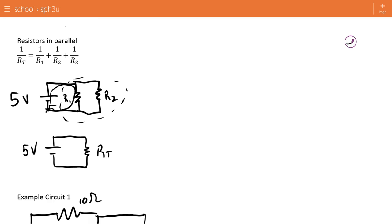We're not going to use Kirchhoff's Voltage Law for this one — we're actually going to use Kirchhoff's Current Law. Kirchhoff's Current Law focuses on the relationship between what I'll call IB for the battery, I1, and I2. Looking at the simplified circuit, the current in the battery is the only current affecting that circuit. Kirchhoff's Current Law says that IB equals I1 plus I2: the amount of current going into the junction equals the total amount coming out.